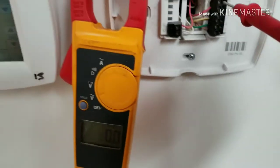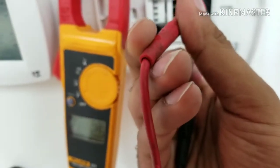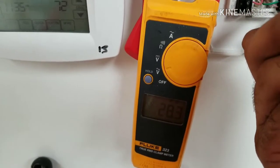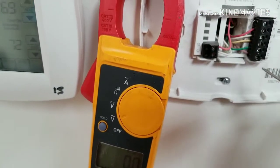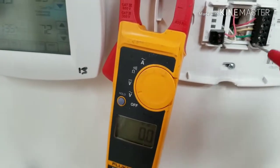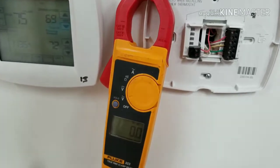As you can see, I put one probe here and another one in the green wire. Right now I'm reading 28 volts, so that one works. You keep doing all of them — just keep one probe here and test the others. If all of them read 24 to 28 volts, it means everything is working, and maybe your problem is somewhere else.